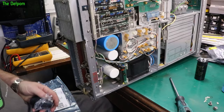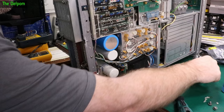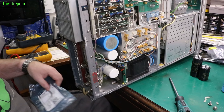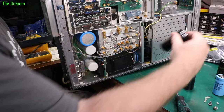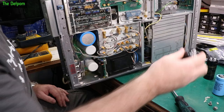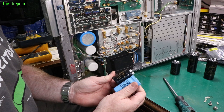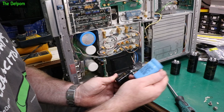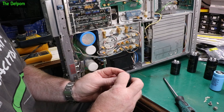I couldn't get exactly the right capacitors so I had to substitute a little bit. The original is 40V 10,000μF; I've got a 40V 36,000μF. And I have a 40V 13,000μF, a 40V 10,000μF, a 40V 36,000μF, and a 100V 4,700μF. All Kemet brand from Digikey. Annoyingly they don't come with any screws. I've got to make sure I get the polarity right — there is a vent hole, and you can actually see the vent holes marked on the PCB.